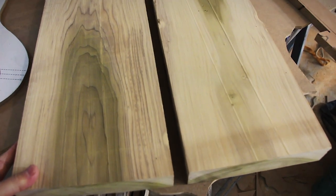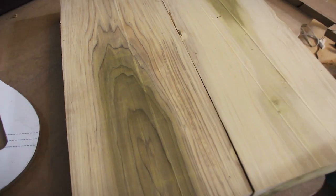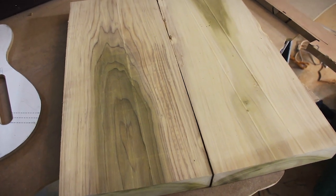I managed to get my hands on a nice, roughly six-meter, almost two-inch-thick beam of poplar, and I'm really going to use it whenever I can. I understand it's comparable to ash and alder as far as tone. The important thing is that it's been drying and acclimatizing indoors for about three years now, so it's as good and as dry as it's going to get. Poplar is on the softer side of the hardwoods and doesn't always have the most unique colors, but in this case I'm going to color it opaque, so it really doesn't matter.